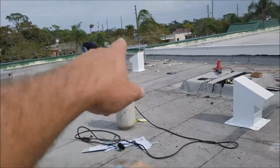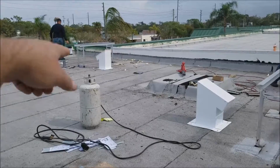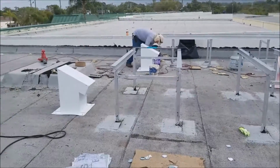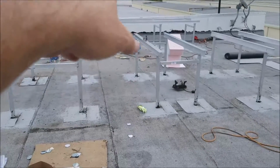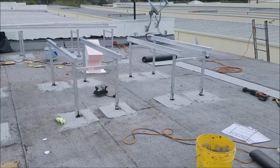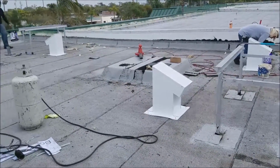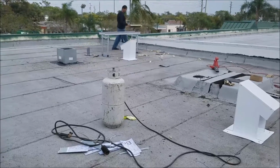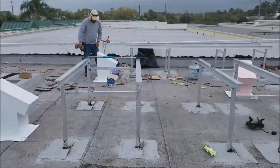So you got that unit there that needs the legs torched down yet. Torch strip around these 4 goosenecks, which basically just torch a strip around them. And then put the Kim curbs, which is basically just caulking, setting, and filling it full. It's 11:42, I think, right now. So this is what's left that needs to be finished before I leave.